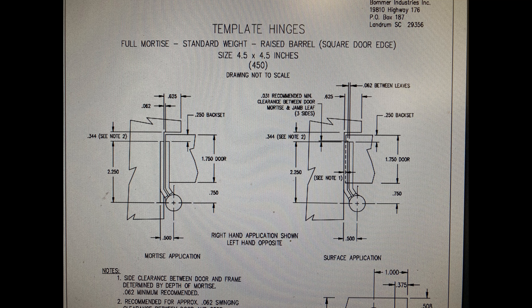I'm having a little trouble understanding this. I can see the plan view under the mortise application. Why do you need the pivot point out to the edge of the post or proud of it? So that the gate does not bind on the post — if the wind blew it open or something like that, it wouldn't bind.